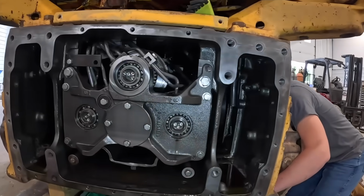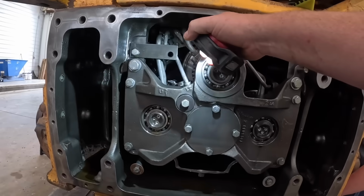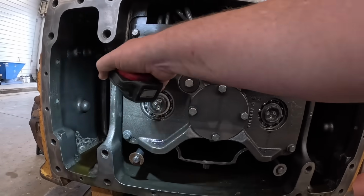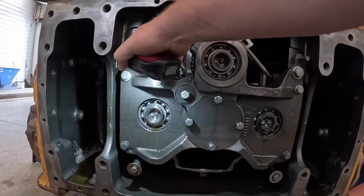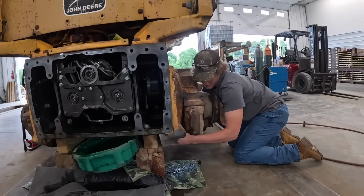So all you have to do on these dudes is pull these two bolts off this rail here. 10 millimeter, you've got to pull out like 4 bolts up here on the piping, and pull out these, I guess, 2 big bolts right here, and this little retainer, and this whole thing will slide right out after pulling those shafts out. You getting her, buddy?